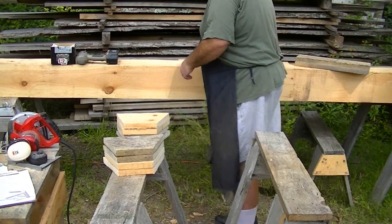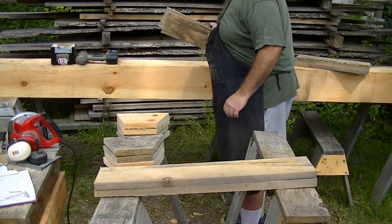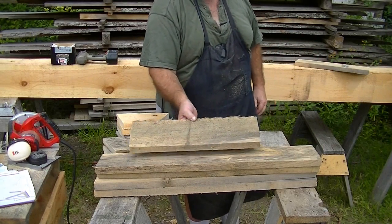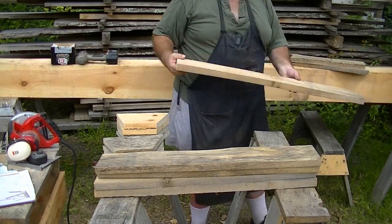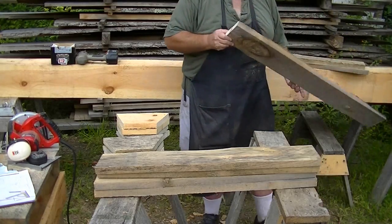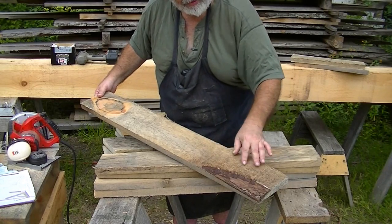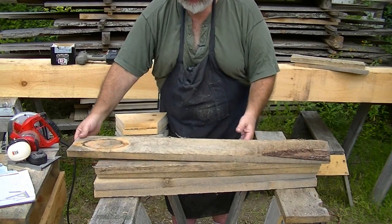I've prepared all the legs which are 32 inches long. I've prepared the stretcher piece which goes between, under the middle — that one I've made 19 inches long. And I have my cap boards that go across the top. You want to stay away from boards that have big knots, as they are very weak even for a leg. And anything that has a splintery edge like this most likely won't work, though it may work as a stretcher to use up the piece.